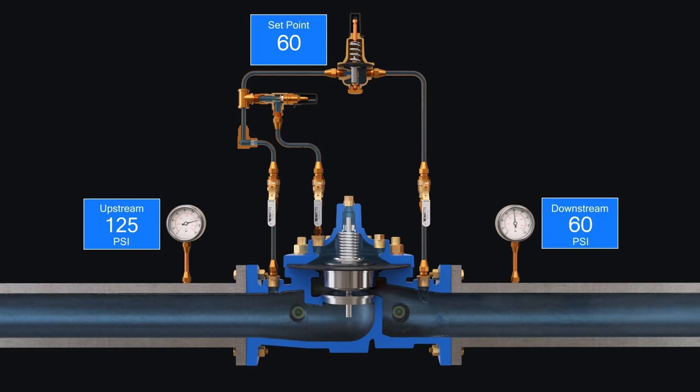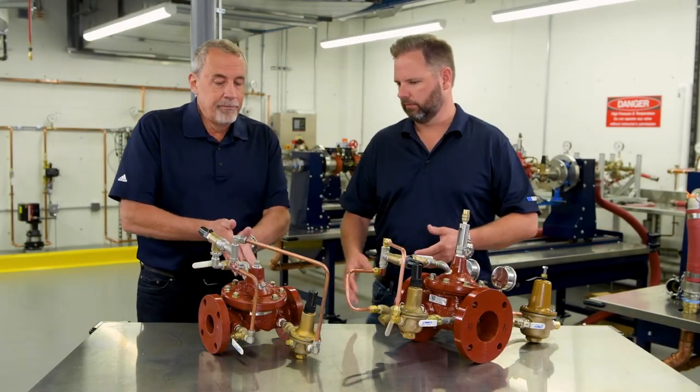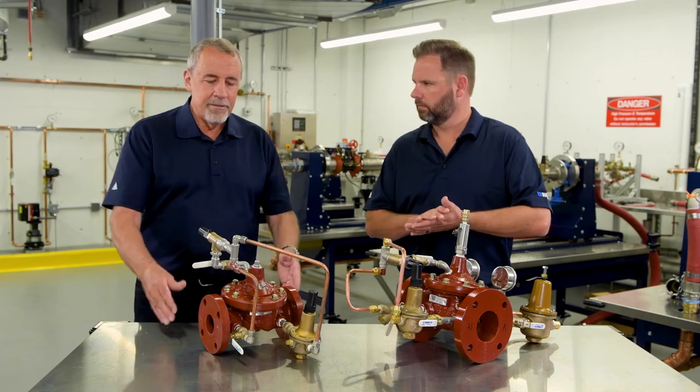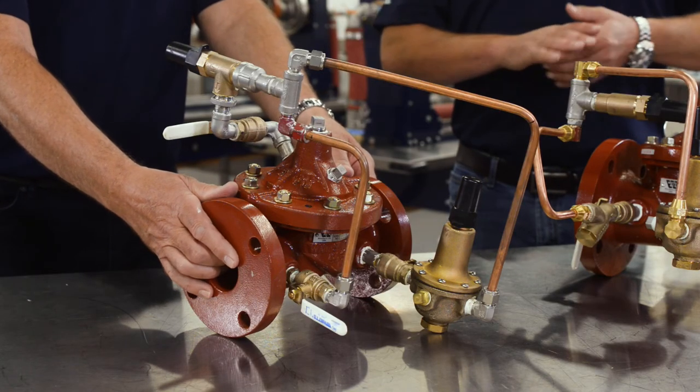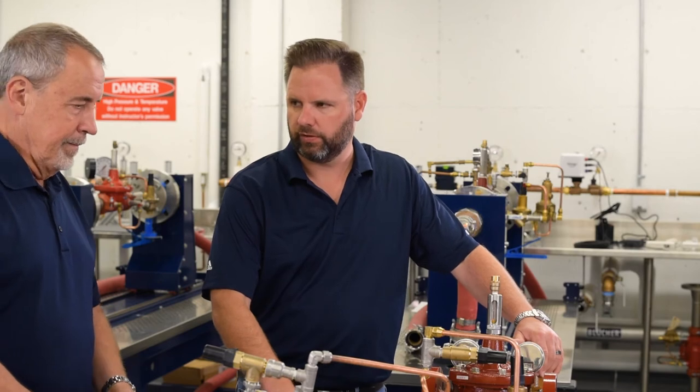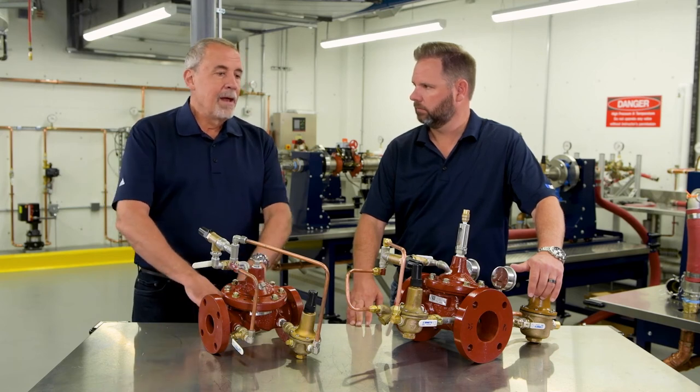So we've walked around the whole product — where do we find these things most typically on a job site? You're going to see it in a commercial building. Let's say you have a 22-story skyscraper; they need 60 psi throughout the entire building. A lot of times city water pressure will be 100 or 120 psi — anything you don't want. So 60 psi downstream is desired. In a building, you'd see incoming water going through an ACV every floor or every fifth floor. It all depends on code and how you balance the full flow. Code is important, so you always want to check with your authority having jurisdiction on what exactly is required. The ACV team is adept at helping you size and map out an entire building — you may end up with 38 valves in a building. We'll help size it, tell you what to buy, and help you actually regulate that 60 psi downstream.